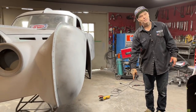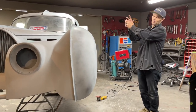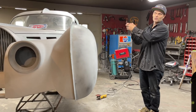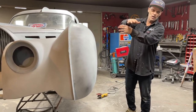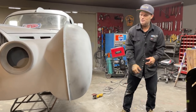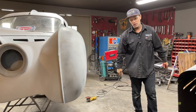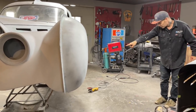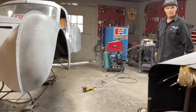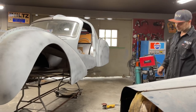A 2-inch piece of pipe down to the ground could sink and be gone. The real question is the metal that you weld to it, is that going to break off? There's where the problem is. Whether the arm you've got welded breaks off or not, the piece going down to the ground does not matter one bit. If you take an egg and try to squeeze it lengthways, you will not break it. If you put it on the side, yes. But that car will not shove that round tubing down to the ground. The only way it would fail is if it got a lean on.